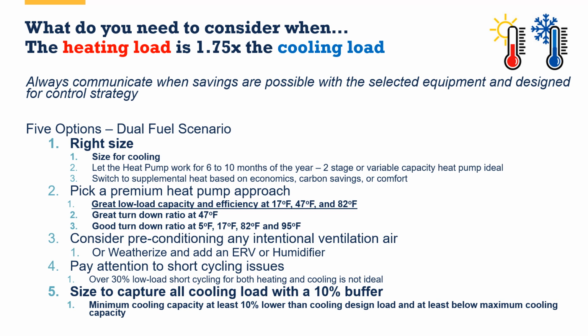When it does that, it transfers some of the heat through the heat exchanger. So if you're exhausting 80 degree air or 70 degree air and it's 30 outside, the incoming air will not come into the house at 30. It will transfer, let's say, 70%, 75% of that heat. So the incoming air is now maybe 60 or 65 degrees. So it makes it a lot easier on the heating system and on your energy bills.